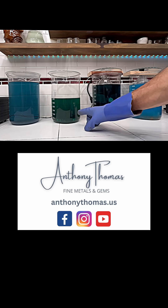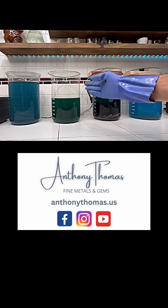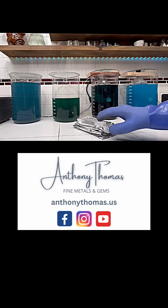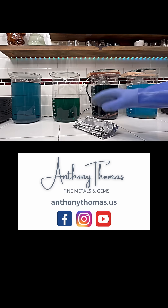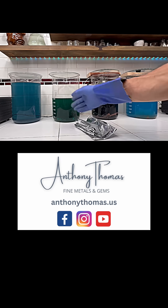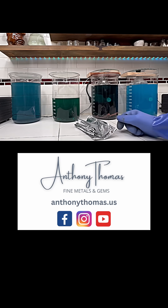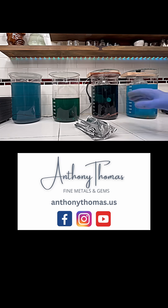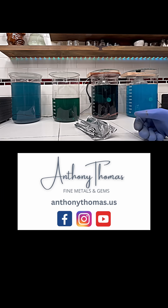In this case we have a fairly pure nickel solution. We're going to add aluminum to this and that's going to drive out all of the nickel. One thing to keep in mind is aluminum foil will have some iron in it, and that's going to color our wastewater that we're going to use for the next step. Pure reagents are highly effective when we're going for purity. But again, this is just a collection step, so we just want to amass as much of the product as we can and then move to a refining step where we make it pure.